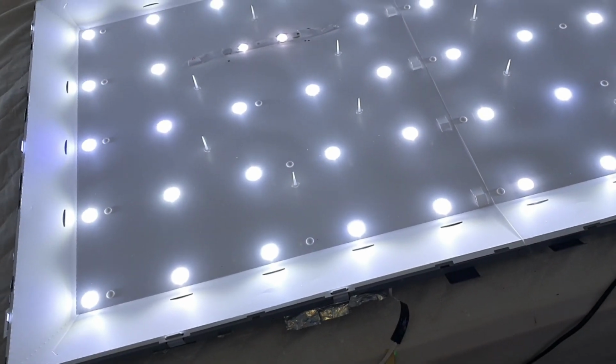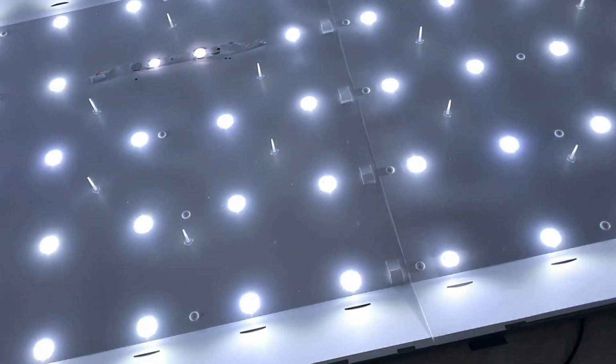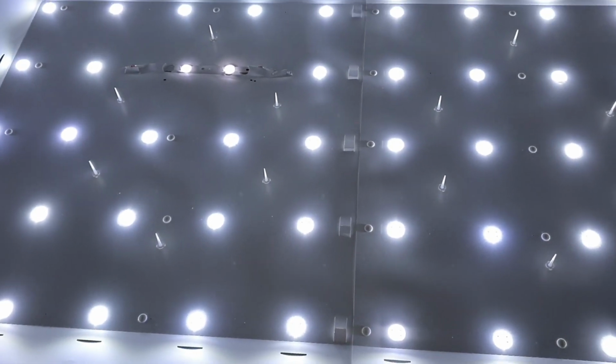So now I'm going to fix this LCD and see how it works. Now I fixed the reflector boards, the white board on top of this LED strip, and let's see whether we can see any dark areas or patches in here because of the new LED replacement. Let's turn on. See, we can't see any considerable differences, so all good.